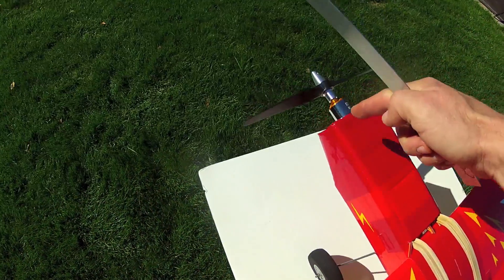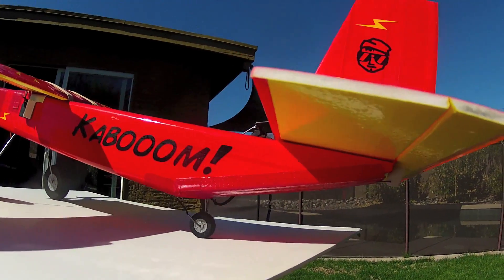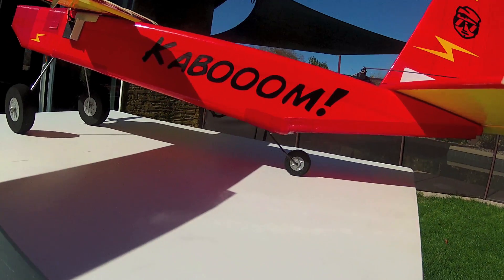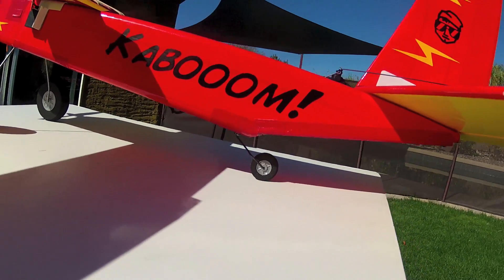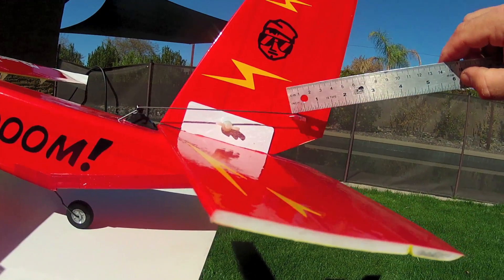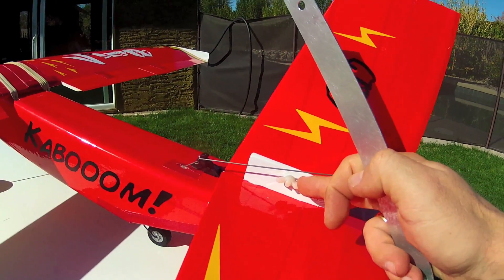It's 30 inches from this point to the tail and is simply tapered up by slicing off the bottom, more or less parallel with the ground. The steerable landing gear is mounted on the flat, non-tapered part just in front of the taper, and is attached via a pushrod through here to the rudder servo, which is attached releasably from the rudder as the vertical stabilizer is detachable with this nylon wing nut.